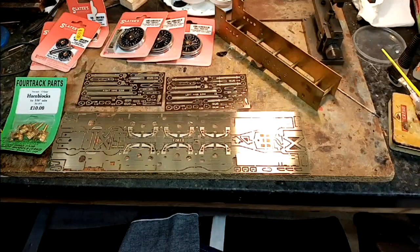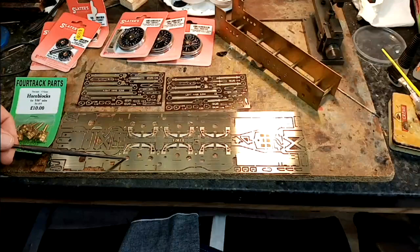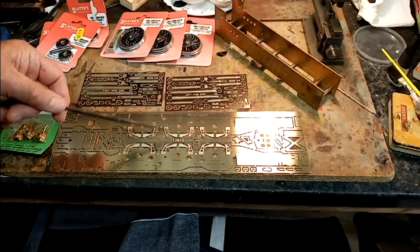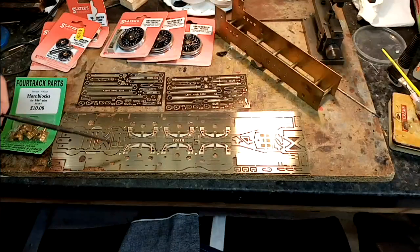What I will show you is the way that I power my engines, or my locos. I always drive onto the rear axle, which I make rigid, and I give vertical movement on the two front axles, the two forward axles. What I will eventually do is put a pivot on the front axle so that it rocks, and the middle axle I'll put some springing onto it.